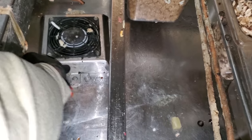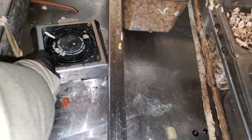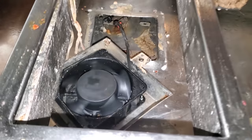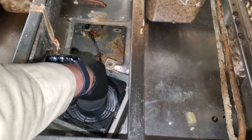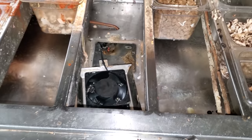We've got the guard off. This should have power, so you've got to be careful — you can only get shocked unnecessarily. It's not iced up, which I'm completely blown away by — it should be frozen solid. But the fan motor is not running. That's interesting. It doesn't feel like it's locked up. I'll have to dive into that.